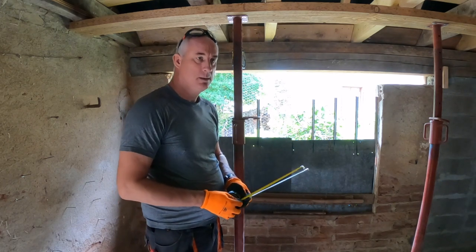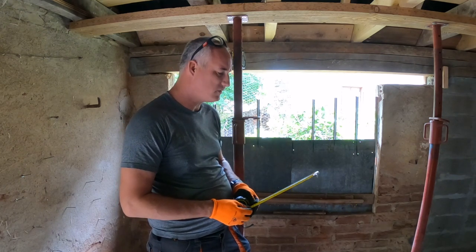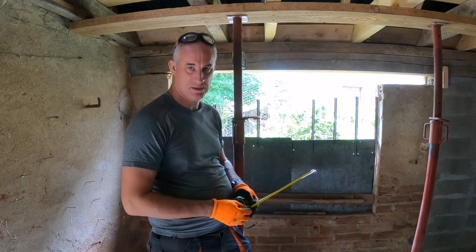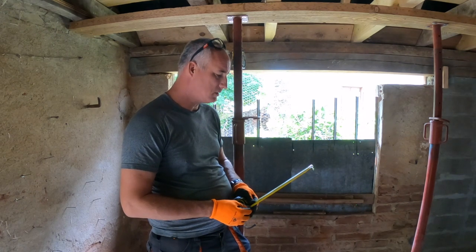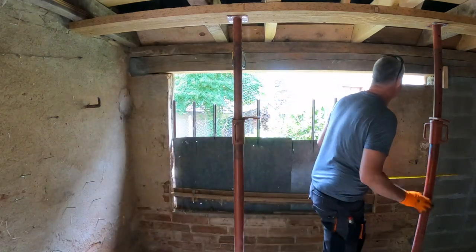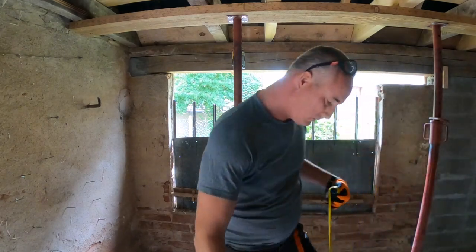And the thing is, I don't necessarily mind cutting twice, but it's really difficult with that heavy grinder to cut a thin strip off. And cutting off too much, I can backfill it with cement, with concrete, but every time it's 24 hours drying time, setting time. So if I make a mistake, it could cost me a lot of time. All right, so these are equal, and this is a pretty sturdy measuring tape. Let me just go again. This is perfectly on edge. And I need a measurement of 259.